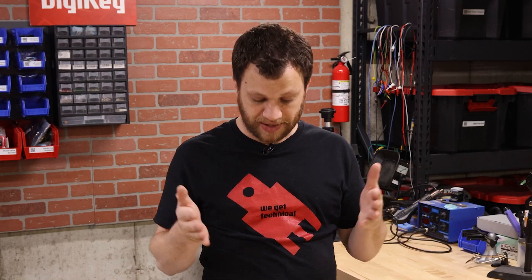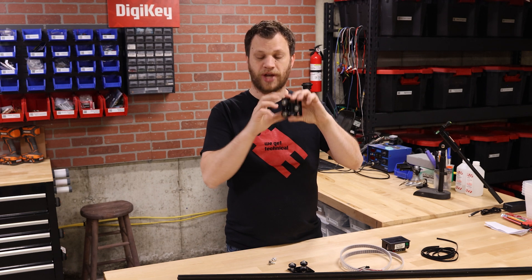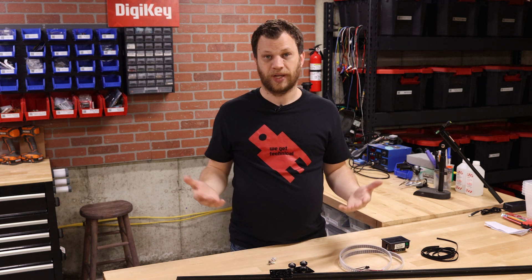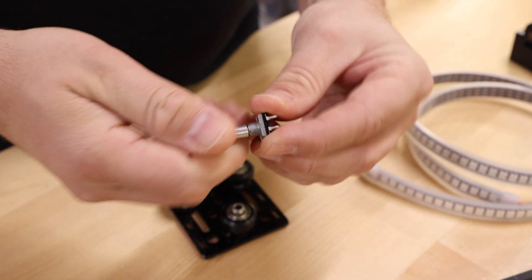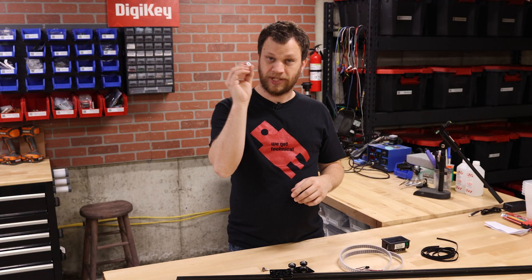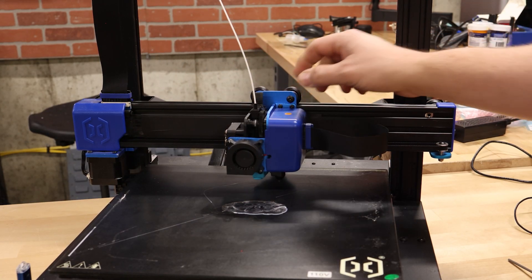Here's the plan. I've got some aluminum extrusion that will be the basis of this project, and then I've got a carriage that has some V-wheels on it. Those V-wheels will slide onto the aluminum extrusion and move up and down. To measure my kids' height I need some way to read that information, so I've got a rotary encoder that spits out pulses as it spins. I'm going to mount the rotary encoder to the carriage and interface a GT timing belt with a GT pulley — kind of like the extruder on a 3D printer, but in reverse: we move the carriage by hand and read that motion using the rotary encoder.